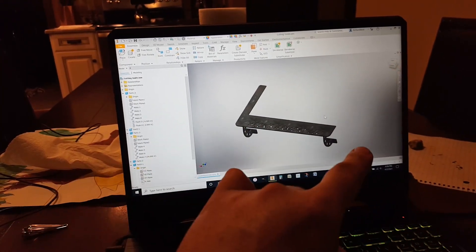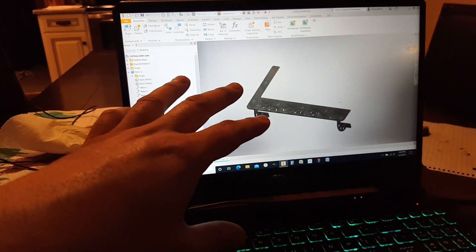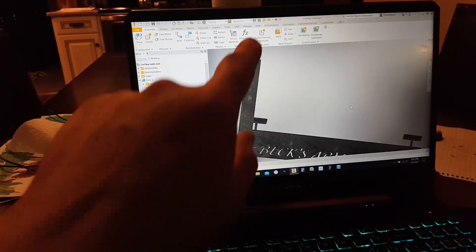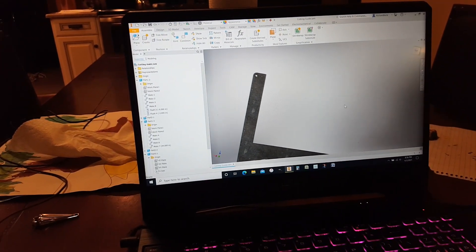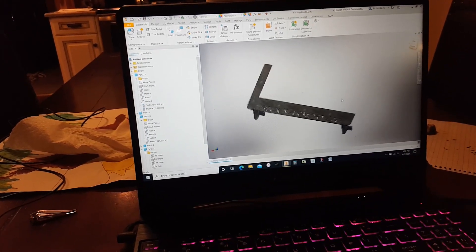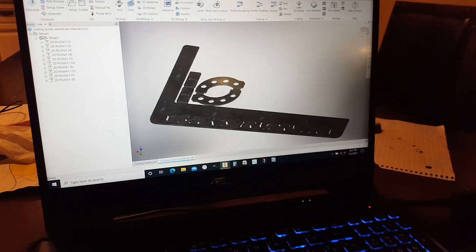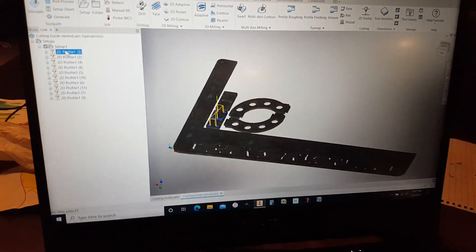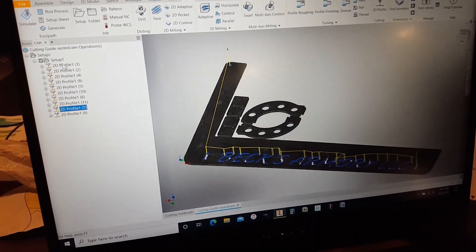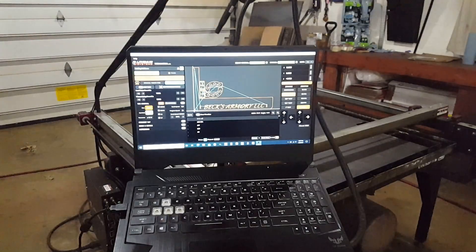This is not going to go the full X or the full Y — I don't need that, it'd just get in my way. This is 24 inches by about 12 inches, so it's just to line things up in the corner. I also have a jack bolt hole right there in the corner, so I'll put a quarter-20 bolt in there with a double nut, and that will just rest on the inside of the water table. Let's check out the nested file — I've got it nested just like that, alternating from inside to outside. You always want to do that; if you cut all the insides first and something moves, you've wasted material. Then we're going to cut this, weld it together, and bolt it on.